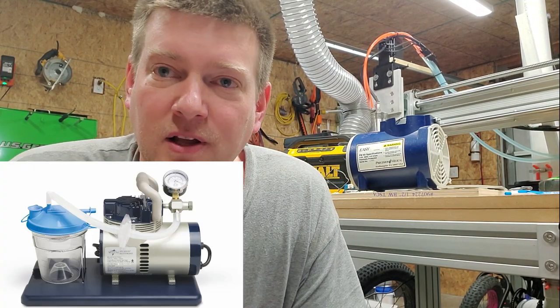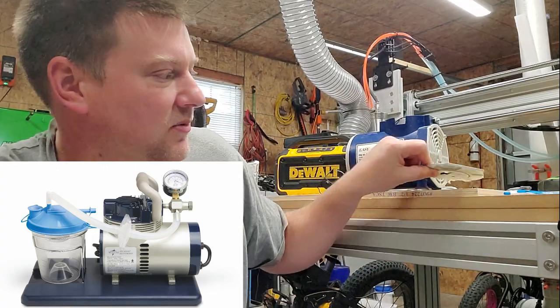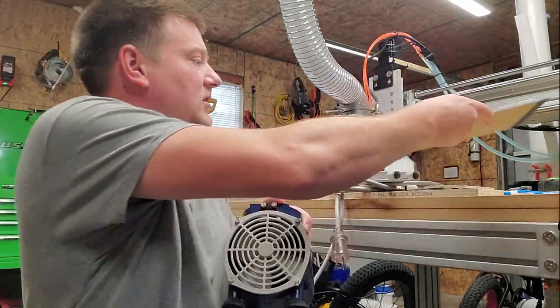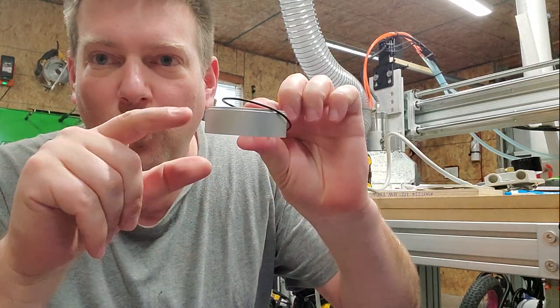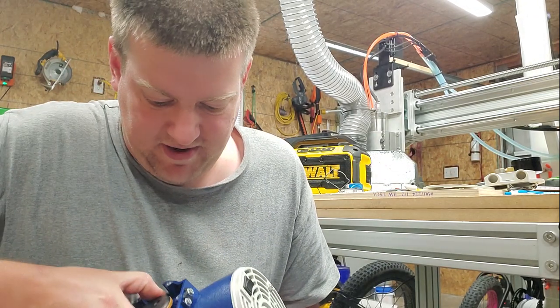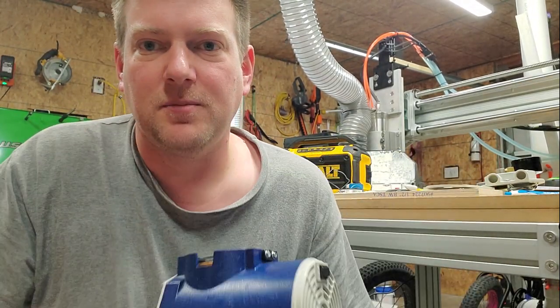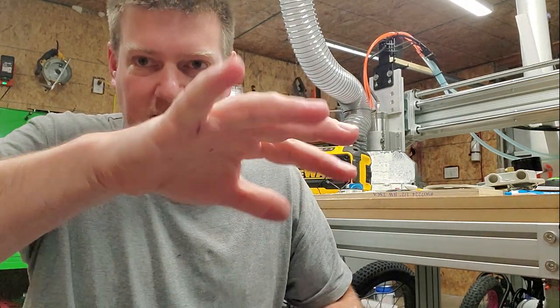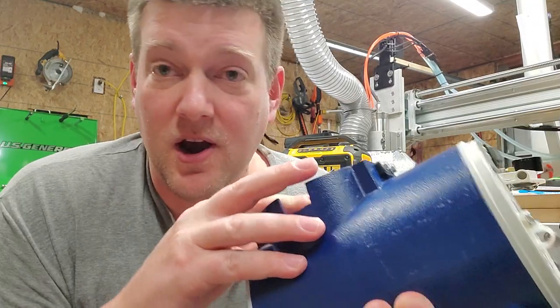Let's move on to the second type of pump — a piston or wobble piston pump. Piston pumps are very low maintenance. They have a little piston that moves up and down with a reed valve. This is the cylinder that the little wobble piston moves back and forth in. The piston is oval in cross-section because as it goes back and forth, it doesn't completely seat against the walls — it teeters back and forth inside the cavity. It depends on really high RPMs to maintain suction. There are some huge advantages to these pumps.